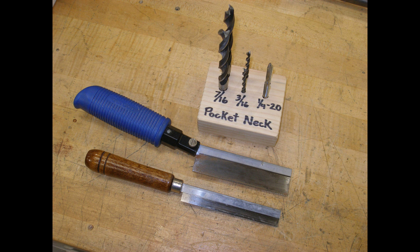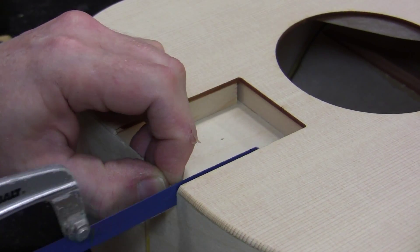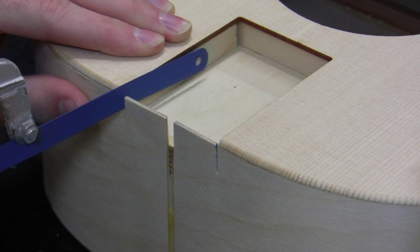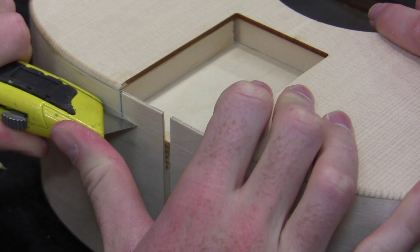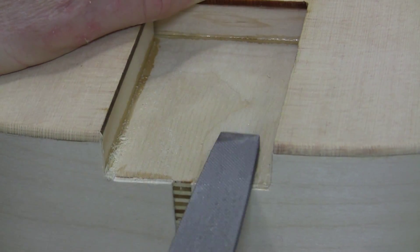Now we're going to prepare the pocket neck joint. On the center table in Loma 5 you'll find these tools. We'll start by using a thin blade — this is a hacksaw, but some of the other blades are better. Cut just inside the laser cut edges, almost to the bottom of the floor of that pocket. Take small cuts so you're careful. Now use a knife and score the plywood just above the floor — score means a little cut in the surface. It makes a weak spot so that if you push hard enough, it'll break those off. Then use a medium file to finish it.